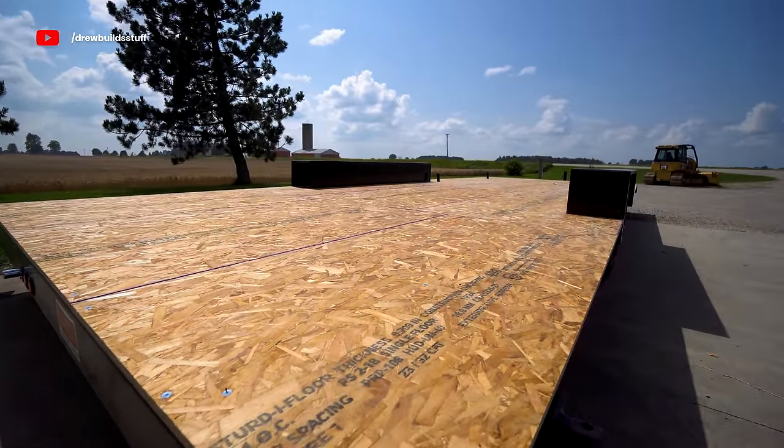Then I just use one strip of flashing tape along the bottom here. And it didn't really need these, but I added two strips of vertical flashing because I'd done it on all the windows already. Now, similar to the window I showed you with the nailing fin, I just used some window silicone to seal around this fin.